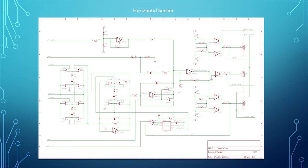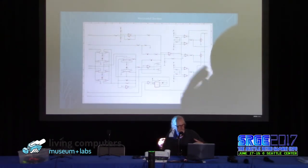And when you're in the serve position, you don't want this center amplifier to do anything. So going through a switch, I turn it into a voltage follower so it just follows ground. It was important to me not to have it go to an extreme up or down position because it could take some time to recover once you re-engage the game. So here it stays in kind of an active mode even though you do some switching.